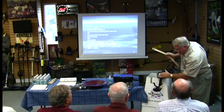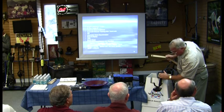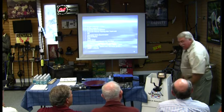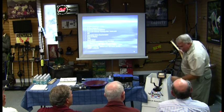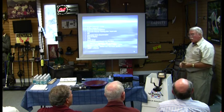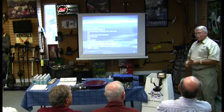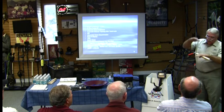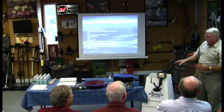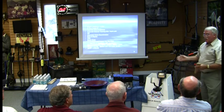Okay, now, it's got on-the-fly depth over here that shows you when you go over a target, that's about 7 inches. It's just a little scale that goes up and down. But if I go to all metal mode, where I find everything, see that? This is the only machine, period, that I know of where the VDI, the target identification, works in all metal mode. That is really a benefit in a tot lot environment. Why is that? Because a lot of the tot lots have this, hear that little chatter in the background? That's your all metal mode, but the tracking, even though it's locked, has tracked out these lights. So now I'm running all metal mode.